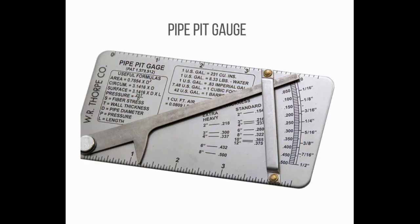Number 17: This small pocket-sized stainless steel gauge is designed to identify the condition of pipe, such as depth of pit and pipe thickness. The gauge includes a 110 mm long scale in metric and inch, with a conversion table available on the back side and formulas on top.